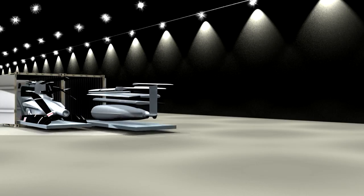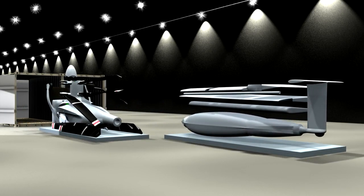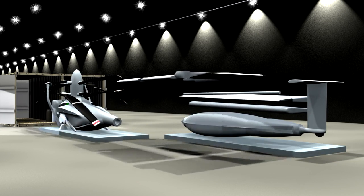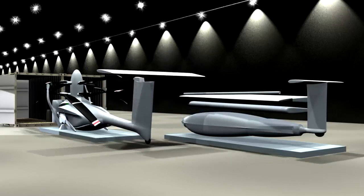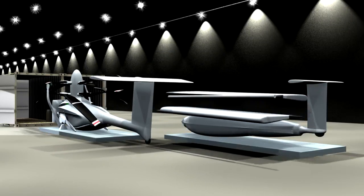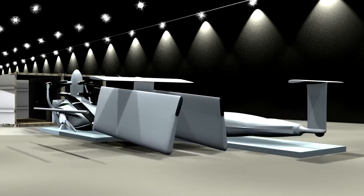The entire aircraft is transportable within two 20-foot containers and assembled on site. First, the nose cone is mounted. Then, four of the eight blades are connected by one bolt each and folded forward. Next, the tail assembly is mounted. After this, the wing spar passes through the backbone and anchors the wing hinges.